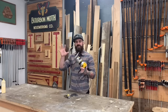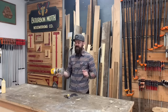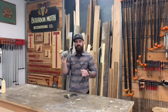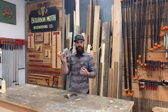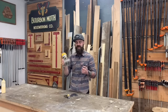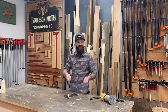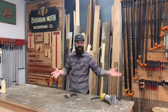You can do roundovers, you can do all your little edge detail, you can put this in jigs to cut out circular tabletops, you can do grooves across to make dado slots to put shelves in. This thing is super universal. As you continue on in your woodworking goals, you might want to upgrade to something bigger because it kind of speeds things up, but I still use this constantly. It is a very good tool to have. Link in the description below. They also make a plunge base for that, so it's crazy versatile. Awesome tool. Can't say enough. I'm not even sponsored by DeWalt.